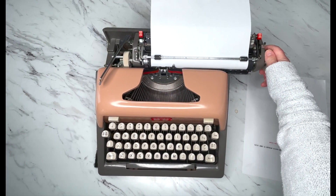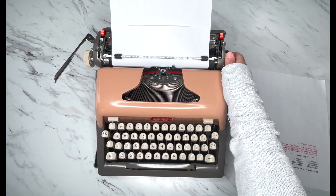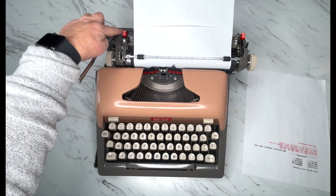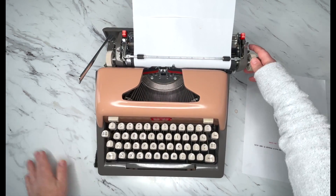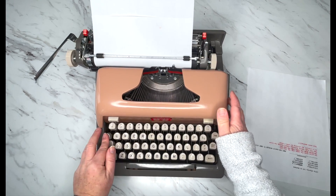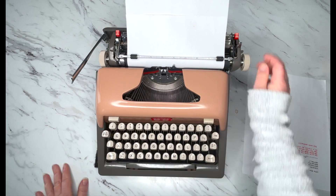That's a pretty wide margin, but standard for a letter. Maybe you want a narrower margin — it's a little bit easier. Just put the carriage where you want it; I'm going to move mine over to 25. Hit magic margin and you hear it click — that tells you it's set. Let's go over to 60 for the right margin. There's that bell — the bell tells you that you're at your margin. Move to 60 and set it; the bell tells you you've just set it. So now I've got narrow margins, which I like for demonstrations.